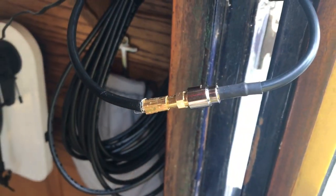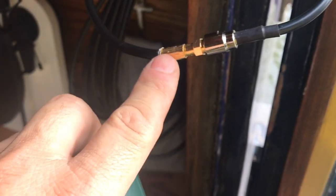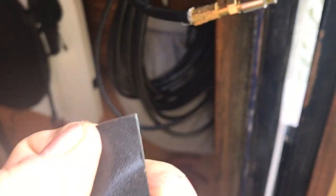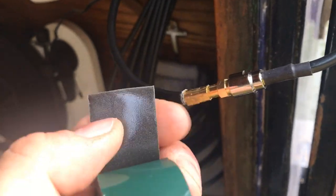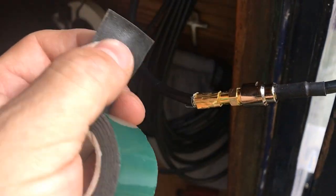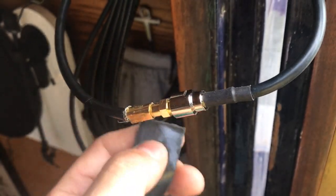Okay, so I've now trimmed that cable down. I've still got the other one to do. I'm now going to fit some amalgamation tape over this terminal here to keep it tight. Amalgamation tape is like the stuff they use on satellite TV cables when they connect to the LNBs on the dishes. It's really stretchy and sticky and holds itself and then sort of welds itself together. So that's going to go around to there and wrap a few times. And then we'll do the other cable.